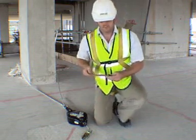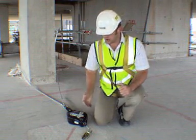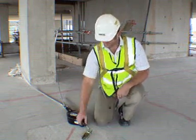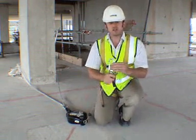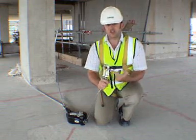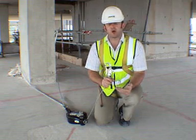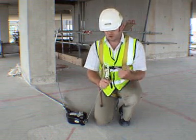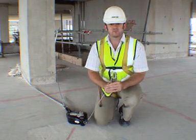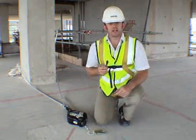The second reason we've put dyneema tails on here is because when you attach straight to the D-ring and you fall, the actual carabiner of the inertia wheel lands on the slab edge. We'll prove that to you when you see the testing part of this DVD. It goes into shear and the gate fails. That is why it's so important to use dyneema tails.